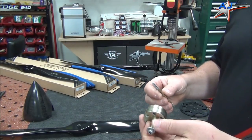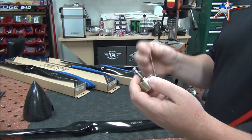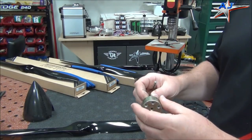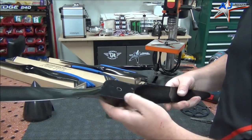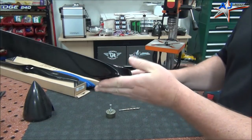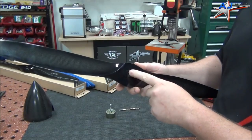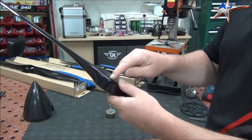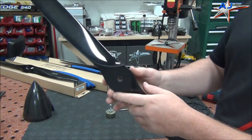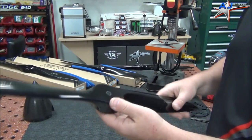It should go without saying, never drill a prop by hand. Just because you have a jig doesn't mean you can drill it by hand — you're likely not going to get that done very well. What you basically always want to do is start drilling from the back. The back is kind of the business end, that's what has to match up to your engine, and so you want to start there to make sure you're starting off correct. If you start out here and you do get a little bit off, next thing you know the holes don't line up with your engine, and then you're drilling holes bigger, or wobbling them out, and you've made a mess of a really nice propeller.